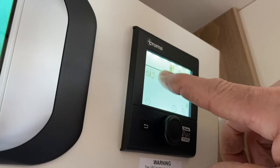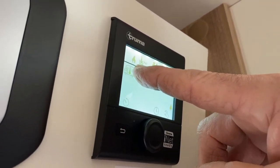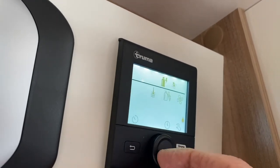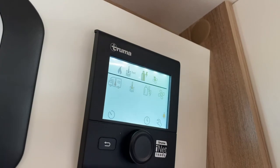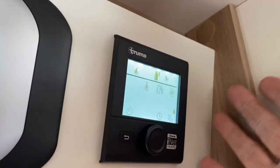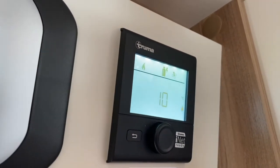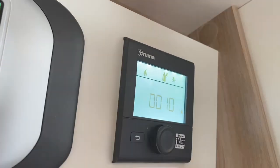That's the quick setup of the top section of the heater menus. When you see flashing symbols on the top line it means the system is heating up. Once temperature is reached, the symbol becomes solid — as you can see there now. The hot water is still heating, shown by the remaining flashing light, but the room thermostat has reached its target temperature. A more detailed video will follow via a link so you can see how the system works to its full extent.